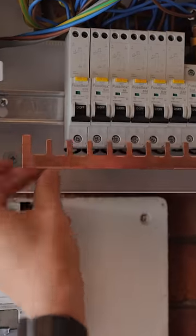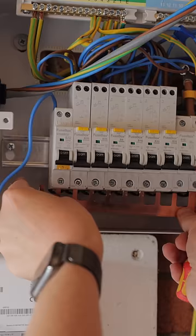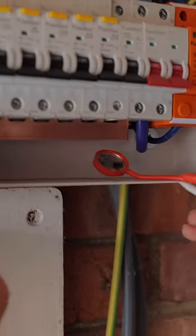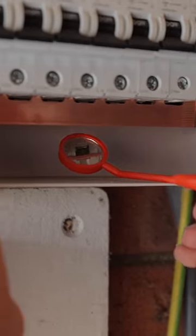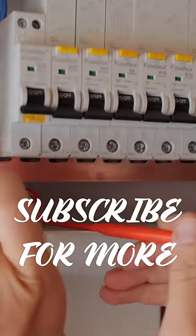It was this way, but the larger bit of copper here should actually come out of the main switch, so it should be like that — pop that in there like that. I've got this great little inspection mirror here so I can just go behind and make sure that the teeth of the bus bar are properly secured within the RCBO.